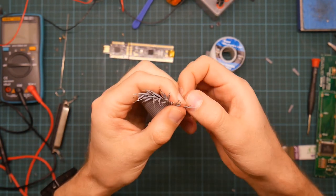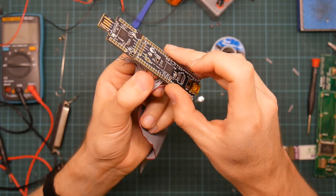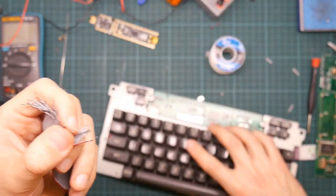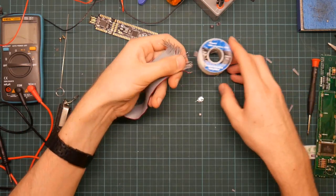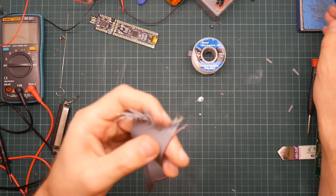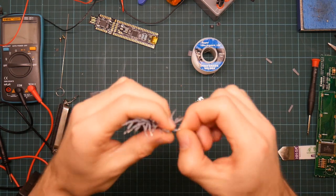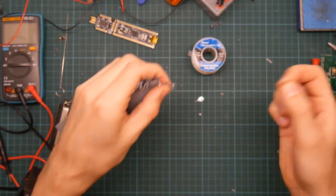If I just straighten the wires, now that should go through the hole anyway, and I can just solder the top without needing to treat them. The holes in this are a bit smaller. Yeah, that doesn't want to go in. They've got a stray strand. I'm going to have to tin them, do it the hard way. One at a time.